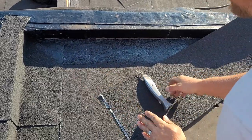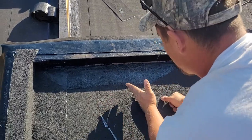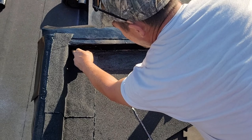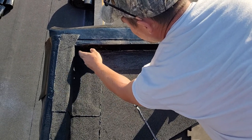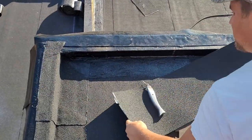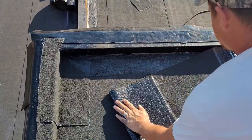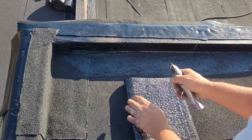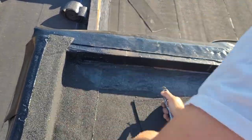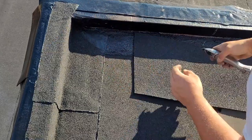Corners like this — I'm going to exaggerate. If this was a tall wall, just the way build-up works, if you cut your line straight and you try to install it, your edge is gonna go out at an angle. So if you're finding your length, you want it to be at an angle where it gets bigger toward the edge — that's an exaggeration but you can see it. That's how you want to install your edge to ensure a tight fit so it doesn't bag out.